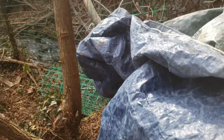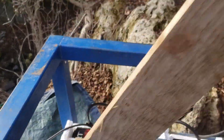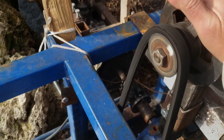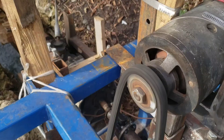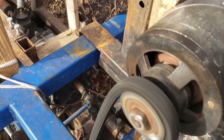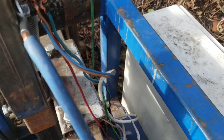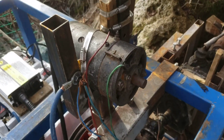Let me show you inside here. As I said before, we're running a dynamo right now because a car alternator doesn't have enough RPMs to run the system. What we have here is a dynamo — it's running hot, which is normal. This one is running at 1,300 to 1,400 RPMs. I don't know what brand it is, but this is the whole system producing our electricity right now.